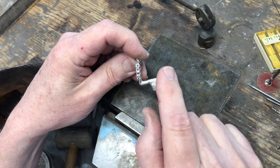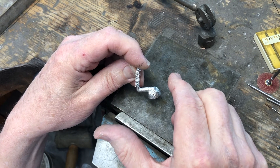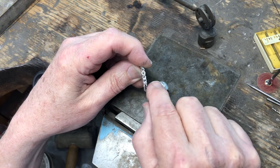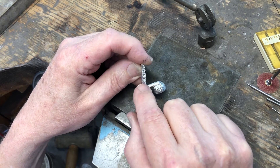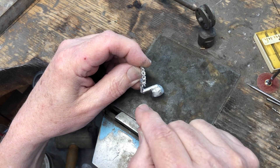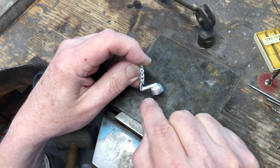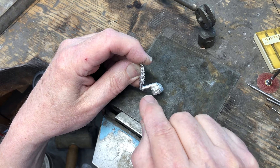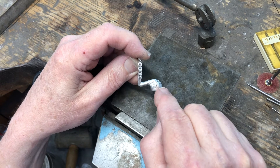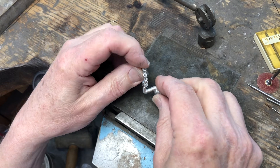When I weigh this up, I zero out my sprue base, then I put this 10 gauge on, then I sprue my piece or pieces on here. If I have a lot to cast, I'll even put something on this side. Once I have everything sprue in place, I weigh the sprue base, times 23 for the wax, and then add 10 pennyweight. So this is roughly about an 18 pennyweight throw. Hope that helps.